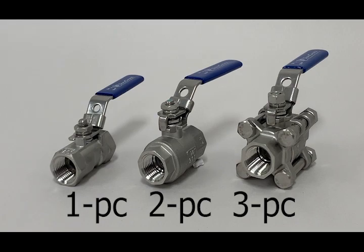The one-piece, two-piece, and three-piece are all stainless steel ball valves. They are ready for action with a stainless steel investment casting body. They operate at a working pressure of 1,000 psi. They also come with blowout-proof stems and a locking handle.